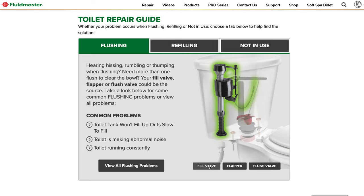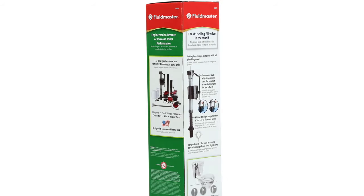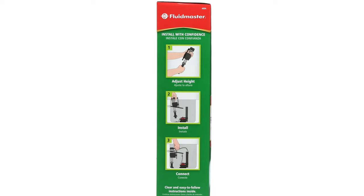You want to be about three quarters of an inch above or below the overflow tube. This makes life much easier if you want to do it yourself — even if you have to drain the whole tank down and reinstall one. These will fit in even Toto. Toto doesn't use them, but I have replaced a lot of toilets with Toto. I always kept 12 on my truck all the time.